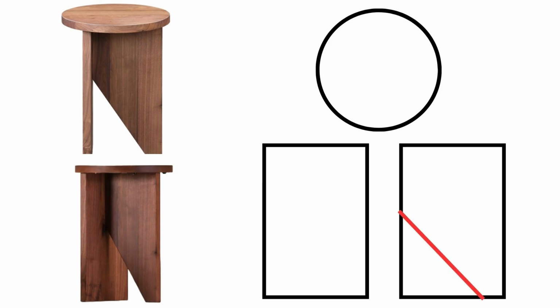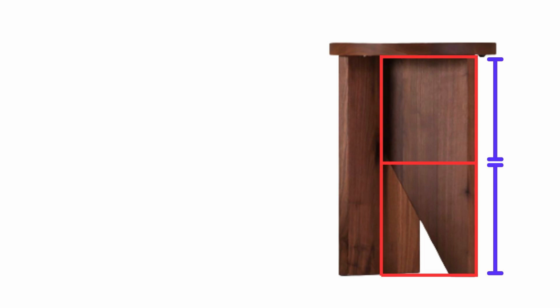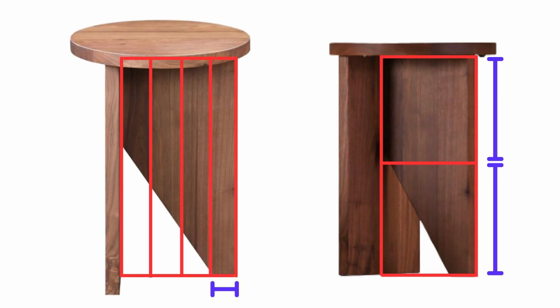You need lumber for a tabletop and 2 legs. You will cut off a triangle shape from one of the legs and connect both legs to the tabletop. And to figure out the dimension of this triangle cutout, I looked at the pictures of different angles. It looks like one corner is at the half of the height, and the other corner is at 1/4 of the width. So if you're making your own dimensions, please use this as a reference.